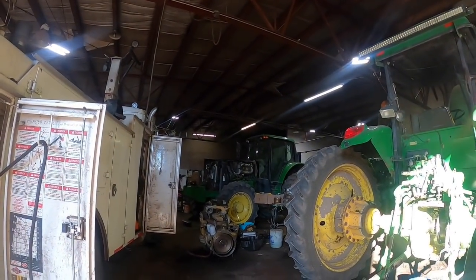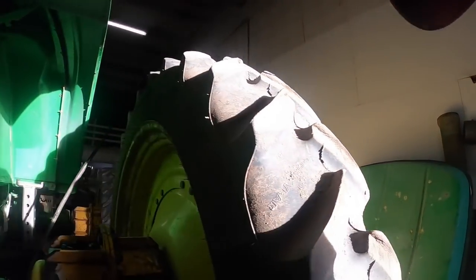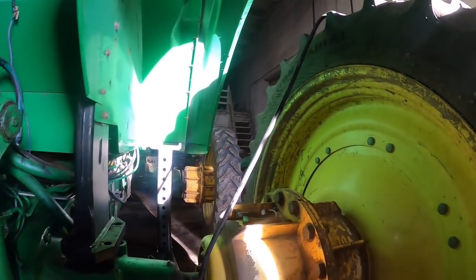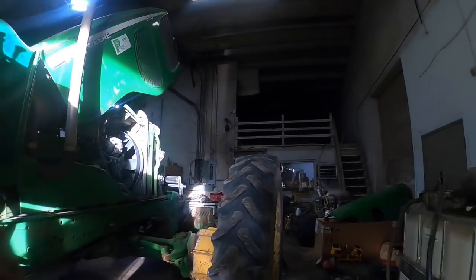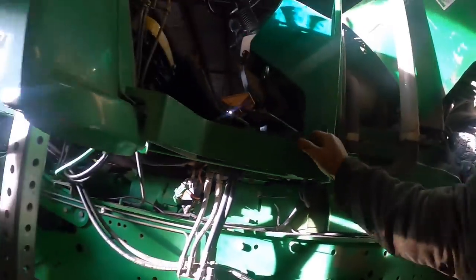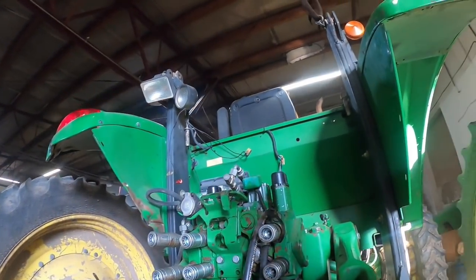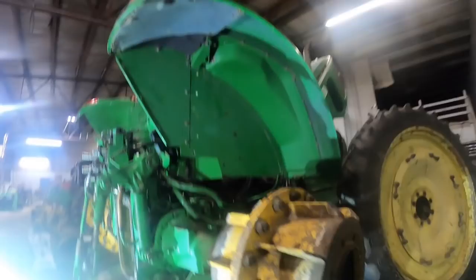Okay, that worked out pretty slick — didn't take me long at all to pop that off. They put a lift eye where one of the pin holes were and lifted it up enough. I was going to use my big tall jack stands but I want to use those under the tractor once I get the tires and finals off. So I just took a big block of wood and stuck it right underneath the cab there on top of the transmission. Now I'm going to take these arms off right here — two bolts here, this one's got a light attached to it, so we'll be mindful of that.